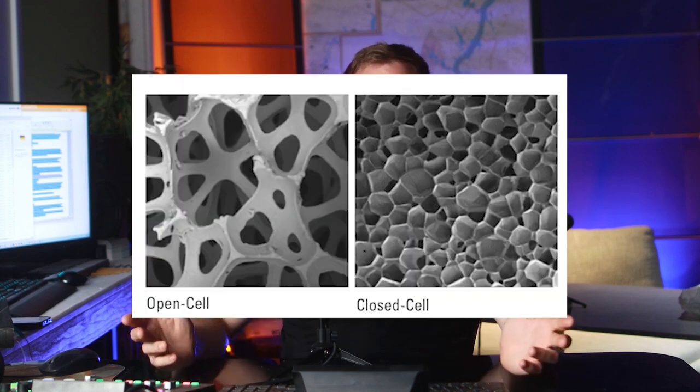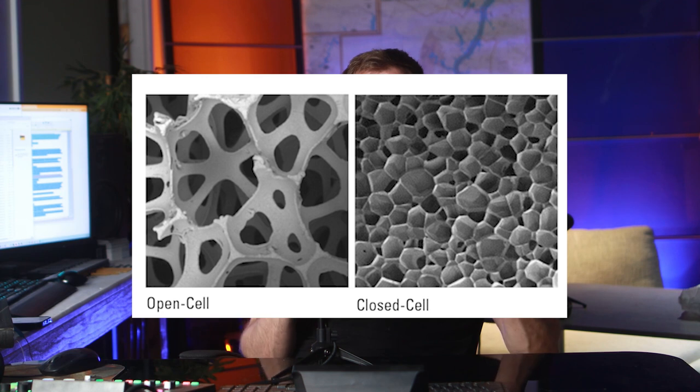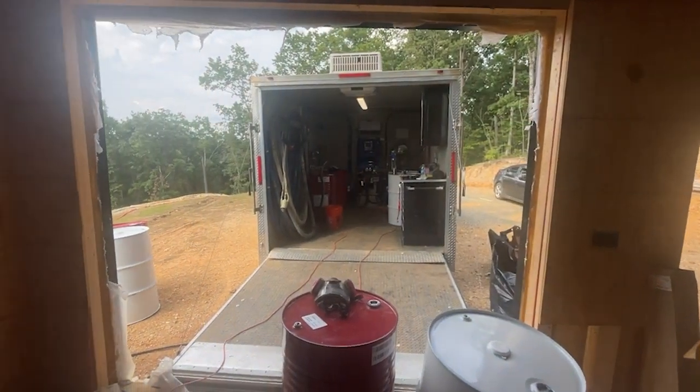Now there's 2 different types of spray foam. There's the closed cell, which is much more dense and compact and watertight. That's the stuff we use on the bottom floor, because the open cell, with the amount we had to get on there, was more than the wood would support, because you had to put like maybe 6 inches of open cell or 3 inches of closed cell, depending on what the package says. It's actually not specific. You don't take my word on how much. You take the word of your spray foam people, because they're different manufacturer specs on their bag or their tube. They actually brought in 55-gallon drums of this junk. It would actually say this stuff is rated for R whatever with this much inches. So that's important to know when your county inspector comes out.